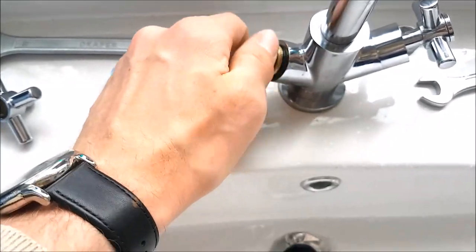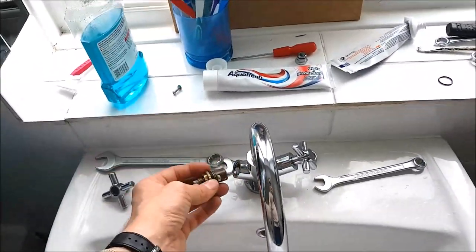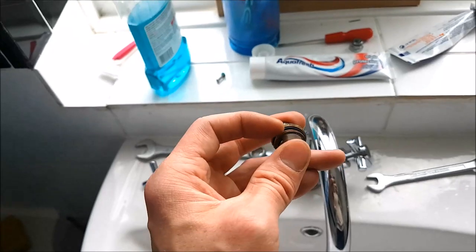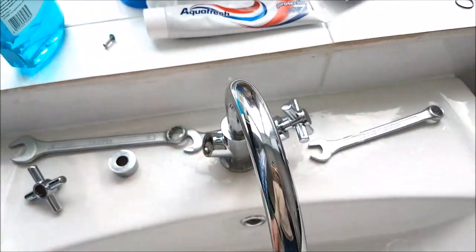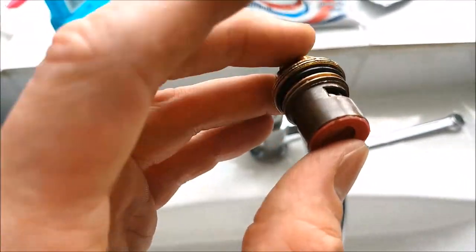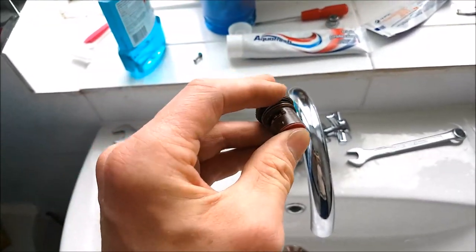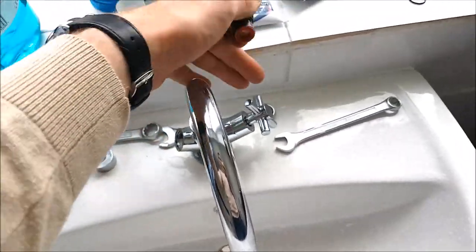This one's kind of tight, and you should have a bit of drippage — that's okay, just let the water drain out. What you're going to do next is take the other valve off, which is the cold water one, take the seal off very gently, then swap both seals over — change the cold water seal to the hot water valve and the hot water seal to the cold water valve. If after swapping, the cold water valve makes noise and the hot water one doesn't, it means the seal has gone and needs replacing. If the noise is still persistent from the hot water tap after swapping, then the valve itself has gone, and you'll need to chase up the valves — they usually come in a pack of two — and swap both over at the same time.